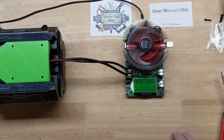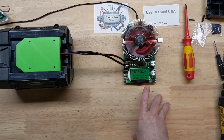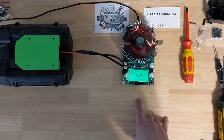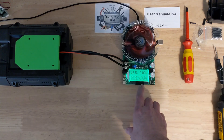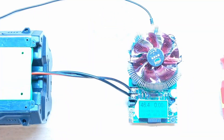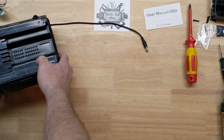We've been running nearly an hour — definitely feel the heat coming off of this. We're right at 2.5 amp hours, holding at 51 volts, so we'll keep on with the test. And here we go — 6.38 amp hours, pretty impressive. We bounced back up to 45 volts pretty quick after shutting off at 42 volts: 6.38 amp hours, 326 watt hours, running the test for almost two and a half hours at roughly two and a half amps. Very, very impressive — going down to three volts per cell cutoff. 6.38 amp hours is my highest capacity pack that I own.